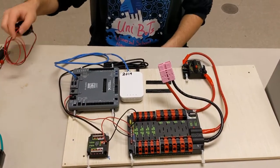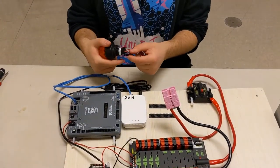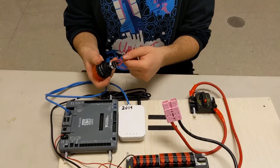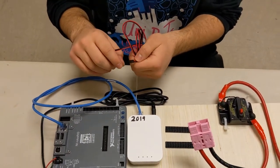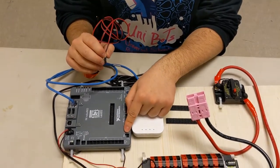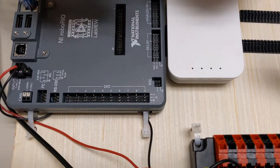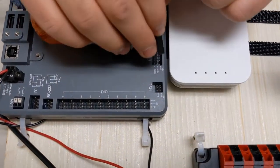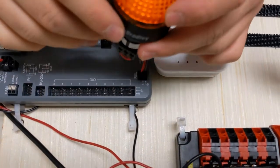Next thing we are going to attach is our robot signal light. That's very simple. There will be a link in the description on how to set up your robot signal light. It's not too difficult. You just have to connect a few wires. But right here, on your RSL, the one with the three lines, that's ground, and that's your black wire. And then the S is your red wire. And you just plug it in. And now you have your robot signal light attached.